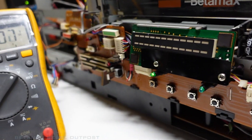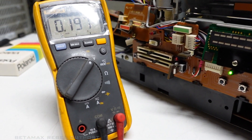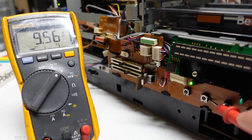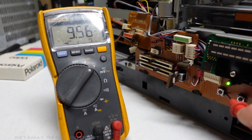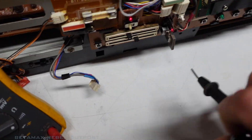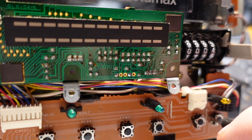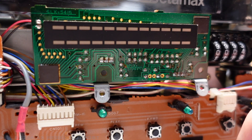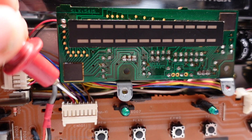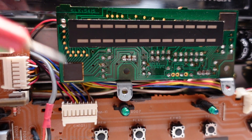With the DMM we'll take a look at this pause enable line. This should be steady at about 9 volts, and you see here it's at 0.2, where other tactile switches are steady at 9.5. I'll just have to trace it out then with the DMM, the continuity tester. The top pin should be ground. The bottom enable pin to pin 4 of CN101 — the yellow wire — is the pause enable. So I'm going to follow this yellow wire and see where it leads inside the system.